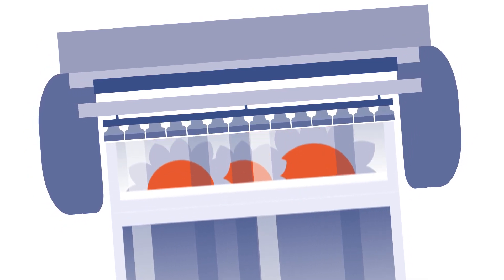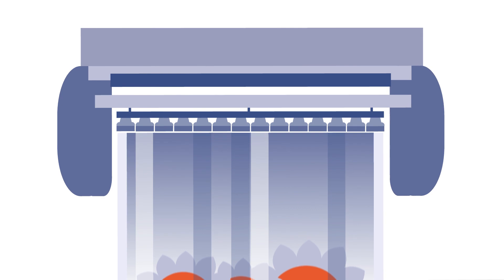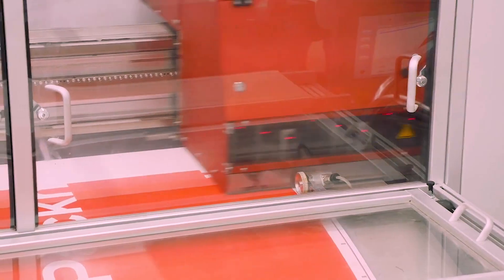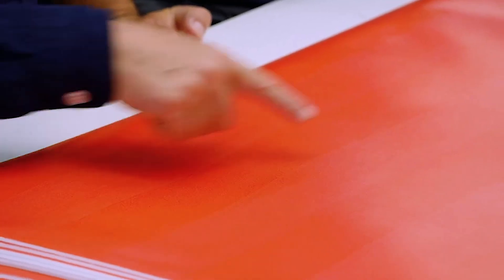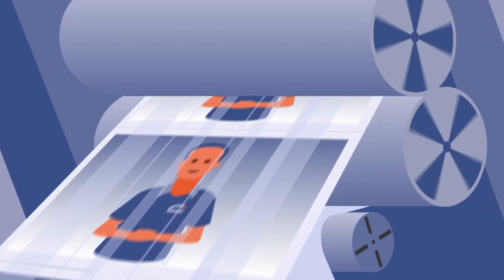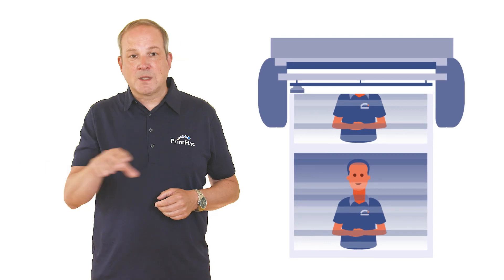Banding is often caused by variation of ink pressure or voltage changes within a head, which typically results in a smile or a frown shape. We also see a certain amount of manufacturing variation between heads, so that one may print lighter or darker than the head next to it in a print bar. And some heads can wear in use, resulting in less regular banding which can change over time. All of these apply to single-pass inkjet presses as well as scanning or multi-pass presses.